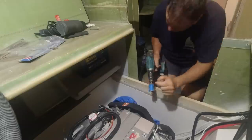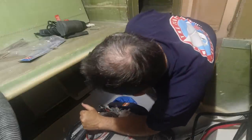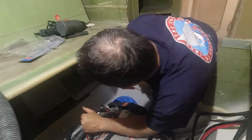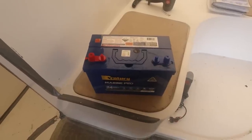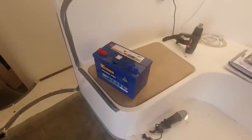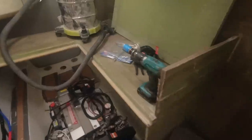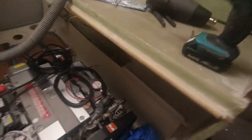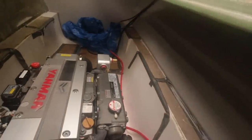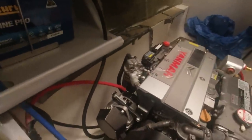These are separate to our house 800 Lithiums and obviously they're AGMs, so we want to make sure that they're totally isolated and separate to the house as it stands. I'll be using solar to charge these on a separate MPPT controller and then we'll have a parallel to keep the voltage regular on each side. I'm going to put them in here and do some work on the port side. Got to get a couple of holes drilled for the terminals. All the cabling is in now — everything running through here, all the power to the start motor.